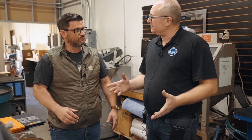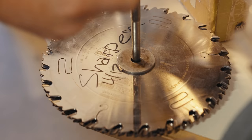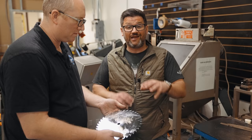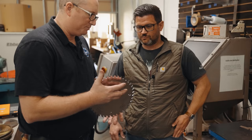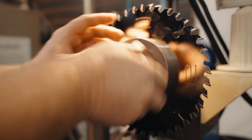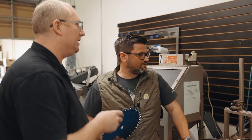Now that we've laser engraved the blade, we're back in the shop. What's our next step, Mike? Now we're going to clean and inspect the blades. Let's head over to the ultrasonic cleaner. Now that we're clean, we're going to inspect the blade. What are we looking for? We're looking for chipped teeth, potential cracks, missing teeth, run-out, rounded corners — all that. This is an optical saw inspection stand. It uses a camera with a fiber light, and we're going to zoom in and look at some of these teeth.